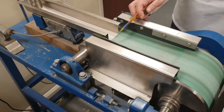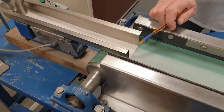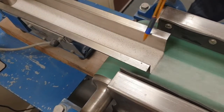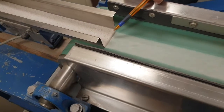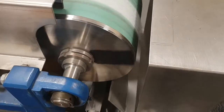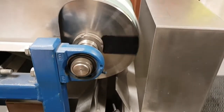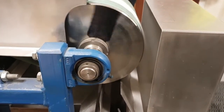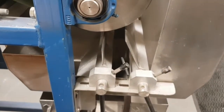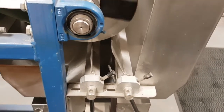We're now running the roll and feeding a monolayer of material onto the roll. This is a mixture of silica sand that contains some black mineral contamination you can see as it feeds over. The majority of that contamination is biotite mica, which contains a degree of iron and is also paramagnetic. The silica sand itself is diamagnetic and is thrown off by its own centrifugal force from the roll. You can see at the bottom that there are splitter plates in position that allow collection of the magnetic fraction and the middlings fraction.